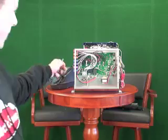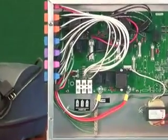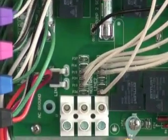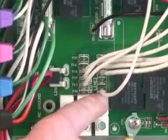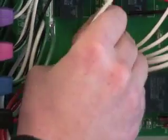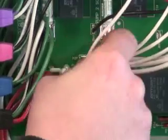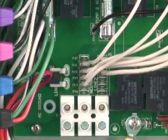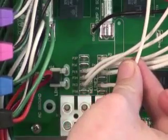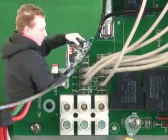On this pack we're going to zoom in on where the spades hook up for the power going to the blower, and I'll show you how to convert it. Coming in, I find the neutral sitting here on line two — this is line two, which is power coming in. I pull this spade off and plug it onto the neutral bar: the neutral is a neutral and the blower will run as 110 volts. Pull it back over and put it on line two and now it has live power, running the blower as 230 volts.